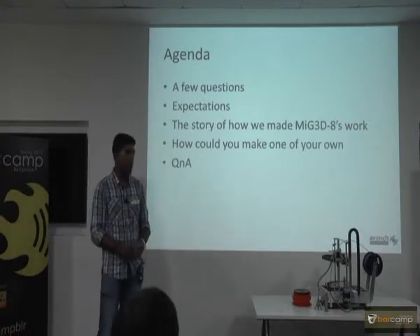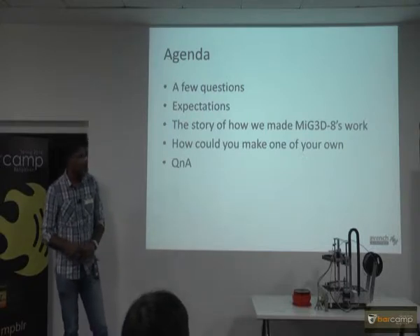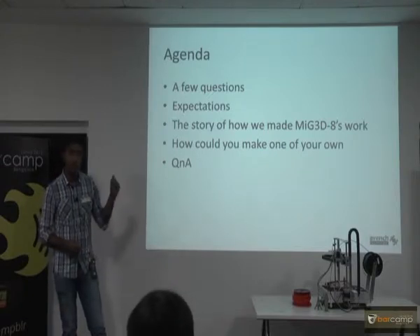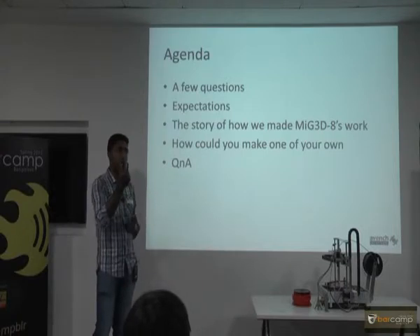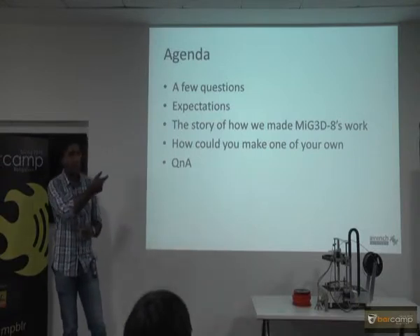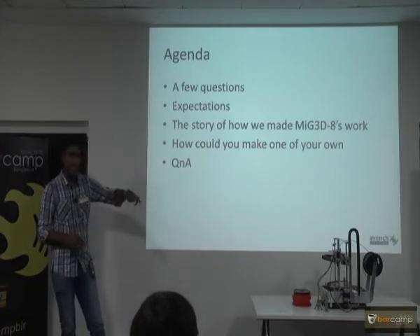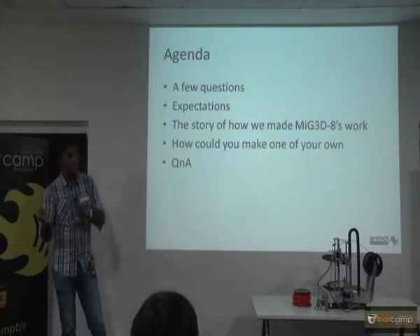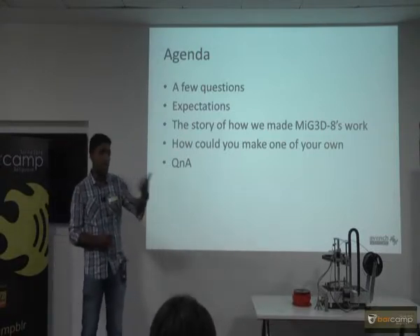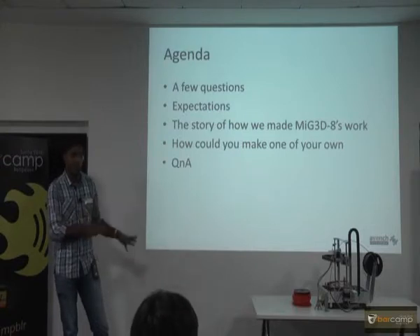Keep a month — if you really want to do this, maybe an hour a day or five hours a week. Getting the mechanical assembly done is the first thing to do, and the second thing would be to tune your drivers. The stepper motor comes with small drivers which need to be current-tuned for their performance — they will have a potentiometer on it, which is nothing but a knob — tune it to get the right speed of movement, then put the belt and everything together. The firmware tuning part — unless you are into electronics, you do not want to do it yourself.